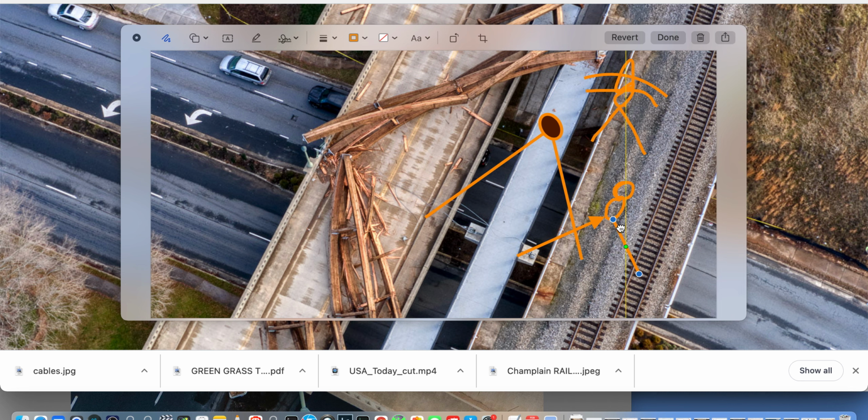Remember, I don't have access to see that connection. I don't have the images to show that. You guys can find it. It'd be great. Now, this would be more balanced, running it through a hook here. So now it can grab better. There's no torque action that you accidentally created by connecting here and down here. One would be wanting to pull this outwards that way. And then the other one over here would want to pull that one that way. So when you go to tighten it, you're actually creating a torque inside there, a tension in there that would want to cause a failure.